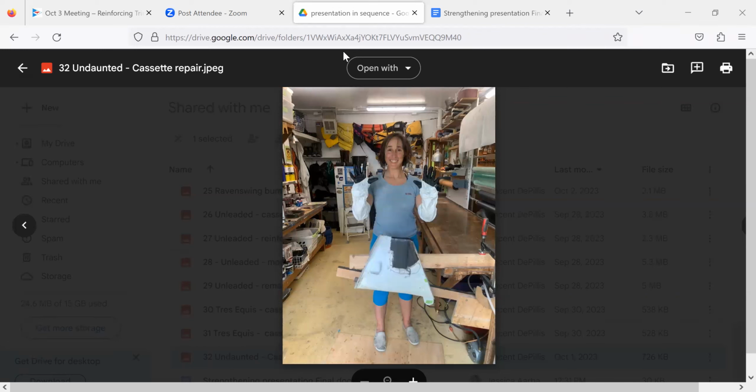This is exactly it, you know, like Gary Sager's rudder cassette with the little weld. Now, obviously, it was welded with trash, right? Just a little weld and it was terrible. But it's also an indication of something not understood. Very, very important. And the blade is raked with the tip of the rudder forward to provide balance. That's how all the Farrier daggerboard rudders are.